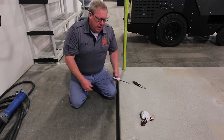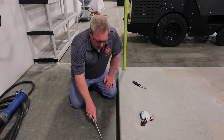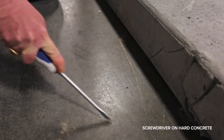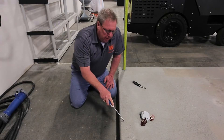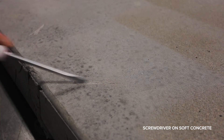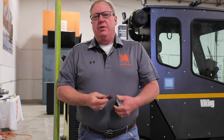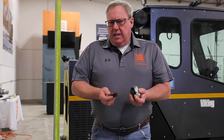If you don't have a pocket knife, a screwdriver does the same thing. If I go back and forth on the hard concrete, it's actually wearing away my screwdriver but not digging into the concrete at all — it is so hard. Then if I go to the soft slab, you can see it's just destroying the surface; I'm digging right through it.